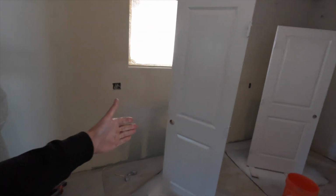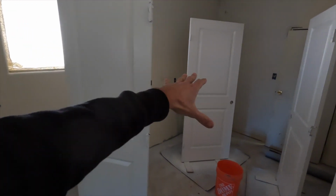I know it's a little dark in here, but the doors actually, again, turned out pretty good. So I think a quick little touch up with a roller, which brings me to a point I always like to bring up when I'm doing any type of painting. Spraying stuff is nice because it gives it a really nice smooth finish, unless you're me and you haven't really dialed in the settings yet. But you can't really touch up a sprayed finish without respraying it.